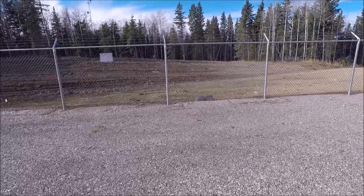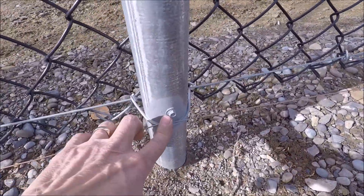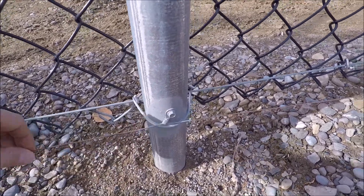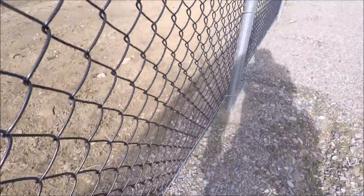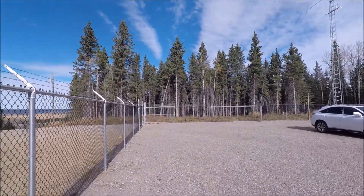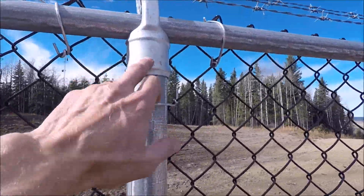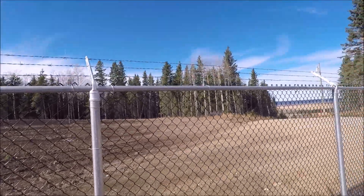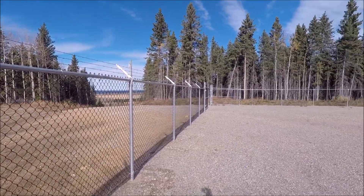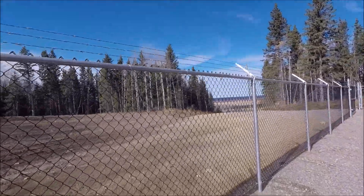I've also tied in the fence. On every galvanized steel fence post I've attached a galvanized steel screw — since painted — and a copper wire which goes around to every single post on the fence, and every radial has been soldered onto this perimeter wire. As a result, the entire galvanized steel fence becomes part of the radial system. On the other side of every post I've driven a galvanized self-tapping screw through each of the caps and the mounts into the post, to eliminate any kind of poor galvanic connection.